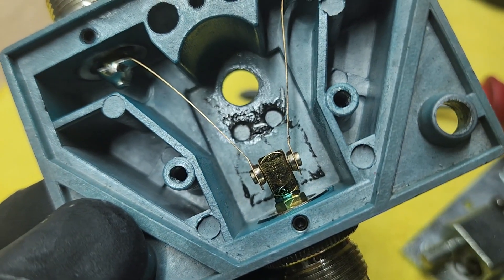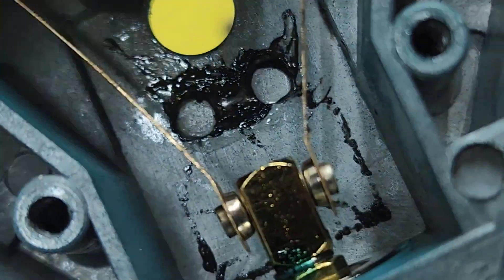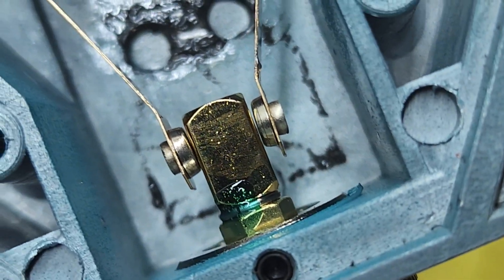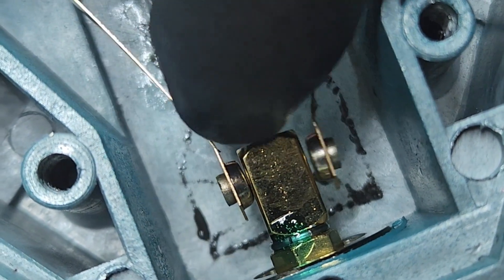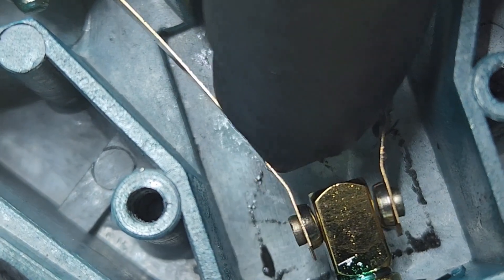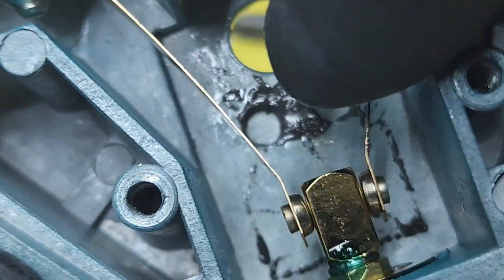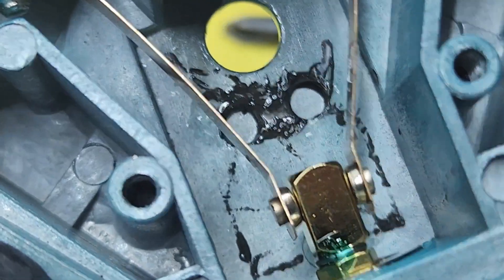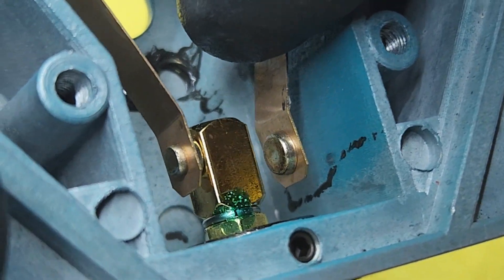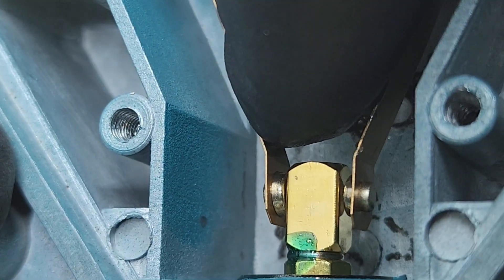I can see there's a gap - let me try to zoom in. There's a gap on that spring right here. This one is touching, but this one has a gap. This one feels much weaker than the other. Either somebody was in here trying to fix something, or maybe they ran more power than this can handle, it got hot and deformed.